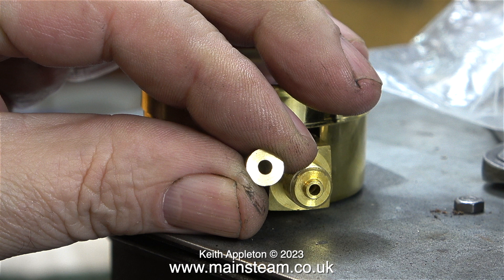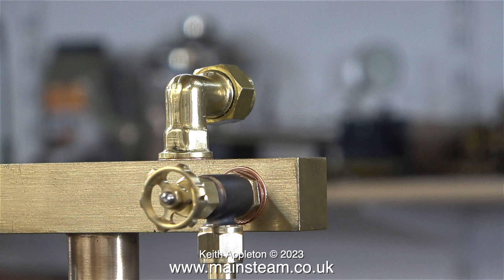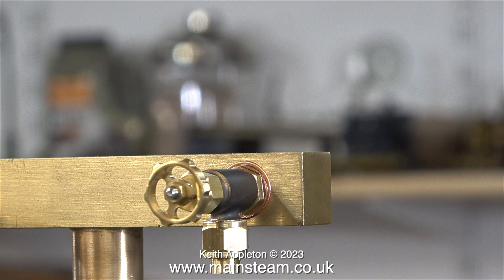The fitting supplied with this gauge is too small. These larger pressure gauges have a guide for the pipe — I think the one on the pressure gauge is designed to sit in the end of a quarter-inch pipe, but this fitting is miles too small. I could drill out the end but then it would be very weak. The original gauge had its fitting on the back, which is why I placed the elbow where you see it, but now I have to move it. There are two holes with blanking plugs on the other side of the turret.